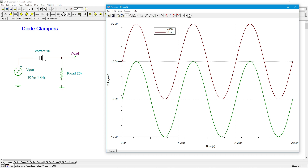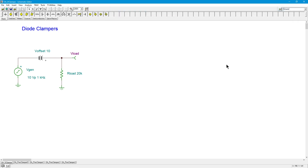The trick here is, it's easy enough to add a DC offset, but as this input changes peak value, we need this thing to change. In other words, I need this to change programmatically, sensitively to the input signal. I need something to hold this potential, to determine what that potential is, and then hold that value.